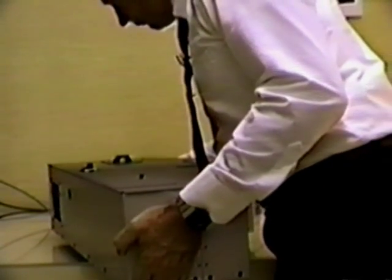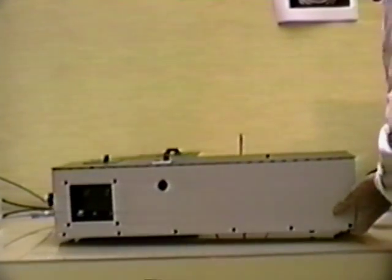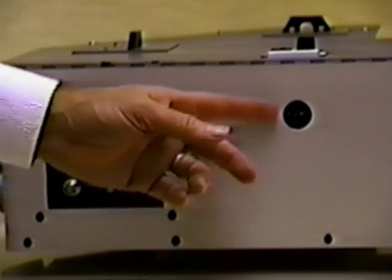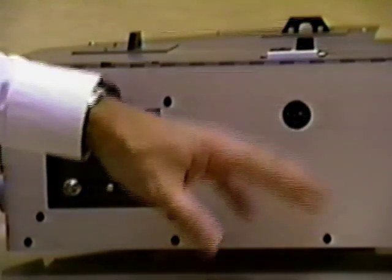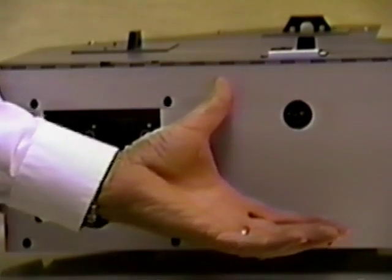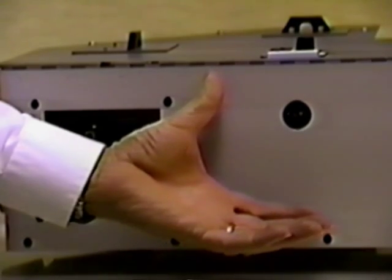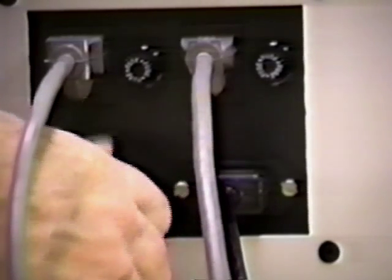The BAT interferometer weighs about 45 pounds and is easily moved. This is the entrance aperture to the monochromator. Your light sources would be set up in this area. The Model 410 comes with a 150 watt quartz tungsten source, and the 210 includes in addition a 75 watt xenon arc source. This is the connector panel. Main power, video out, and two fused accessory outlets.